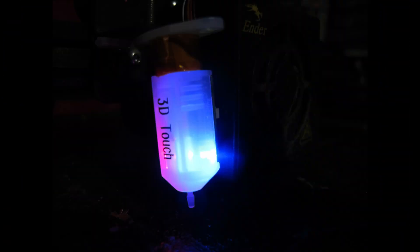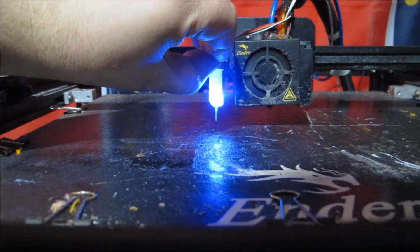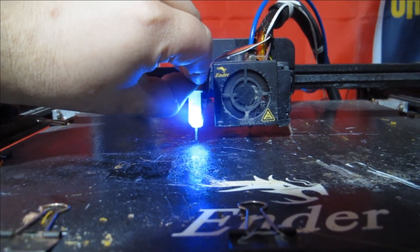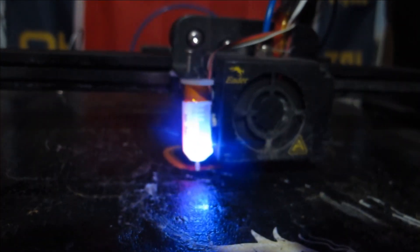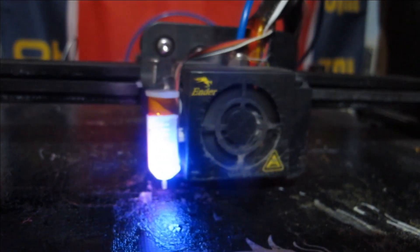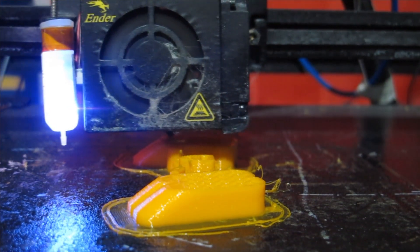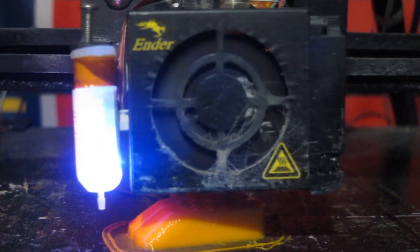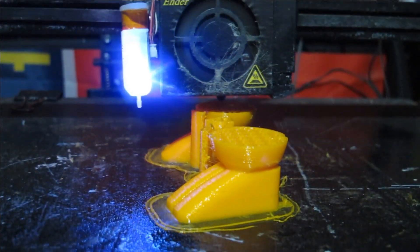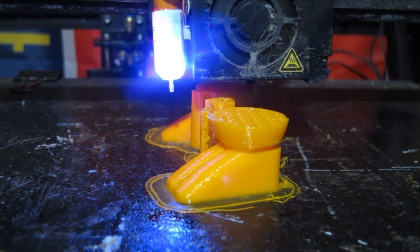What is different and impressive is the blue LED over the original red. To my relief and excitement, the 3D printer responded to this exactly the same as the original BLTouch and performed a bed level just before a print. A 3D printer auto level is not perfect and may sit on the surface instead of getting a nice transparent squish. A slight quarter-turn adjustment on the Z-axis bolt is not necessarily a terrible thing. You can see the first two lines are a bit strange in the brim, which I like to use for adjustment, and everything else was ideal.